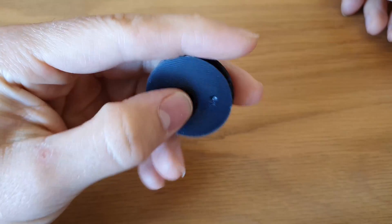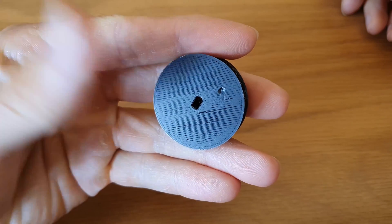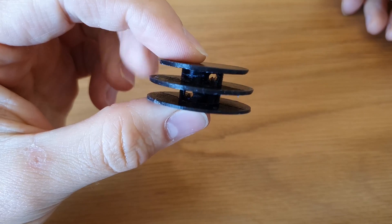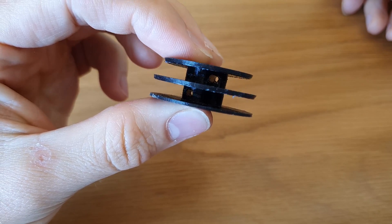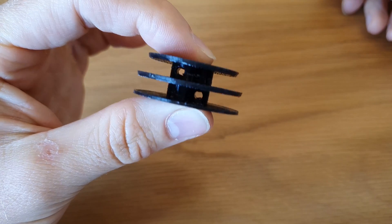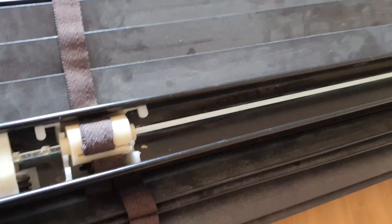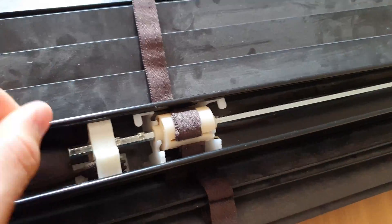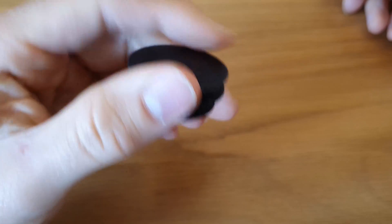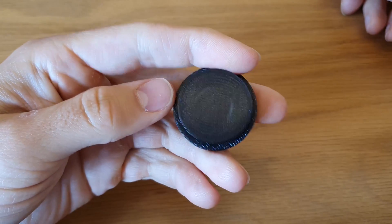You will also need to 3D print the part for this spooler, which attaches to the motor shaft and is responsible for winding the cord in and out, which will open and close the blind. You can see there is a hole top and bottom which the cord will thread into. It's worth noting this wasn't my preferred method — I'd much rather have turned the shaft directly, but in my case the shaft was far too stiff and the motor wasn't up to the task. So this is the alternate solution I came up with. You'll find the link for this spooler down below.